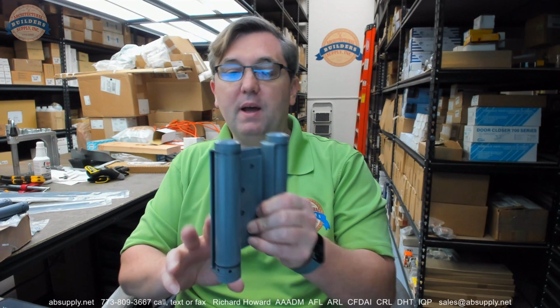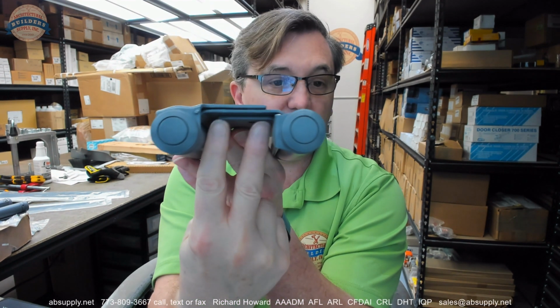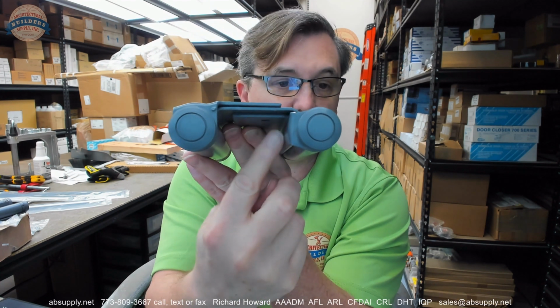We talked about its door thickness, 1 3/8 to 1 3/4. Again, it's not recommended, but you could fit a thicker door into this door pocket, but you're going to have to count on notching it. And I've seen people do it, and it certainly worked. But you're really dealing with the weight of the door and the width of the door, more so than the thickness of the door when it comes to the success of the installation.